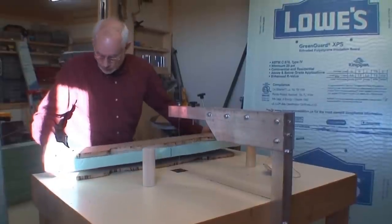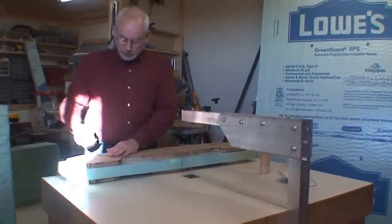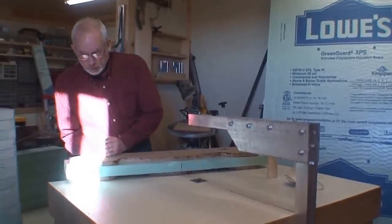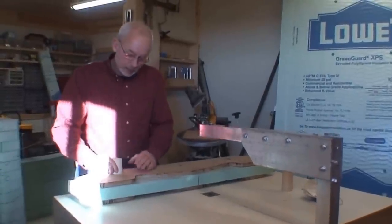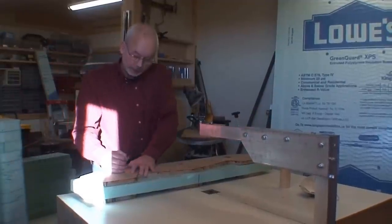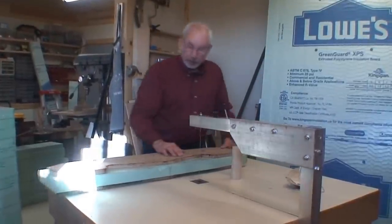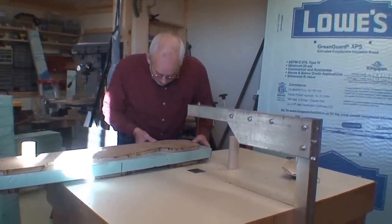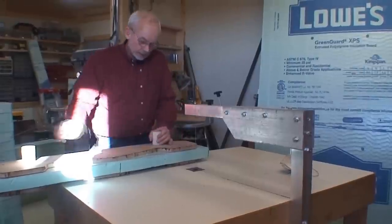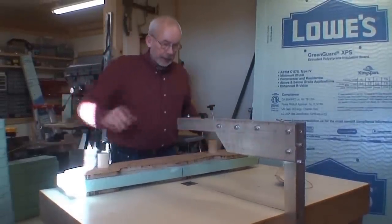What we need to do is take the one we've drilled and line it up with one set of holes — you don't have to worry about the other side yet. We get this hole lined up with the bottom MDF and run a two-inch dowel down through these precisely Forstner-bit-drilled two-inch holes — that gives a perfect alignment. Now we're perfectly aligned with the top and the bottom, so we come over to the other side, line it up, and run the other dowel down. You can reach down and check to make sure it's all the way through on both sides.